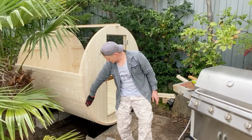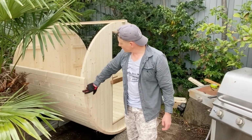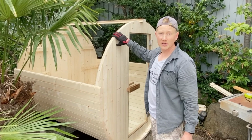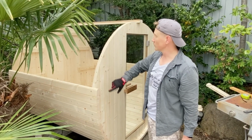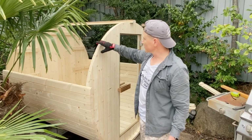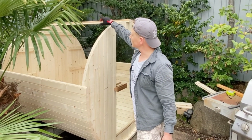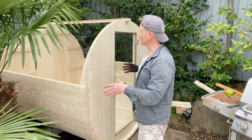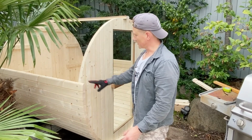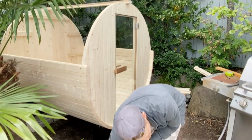Temporarily secured the side staves with screws. You can see they're not in all the way. From this point, we can just put the staves on, and they should be able to stay in position until we put the straps over. With this one, it could be a bit trickier because we also need to align the ceiling section, which has an opening for the flue to come through, with where the firewood heater position will be. So we'll have to work around a little bit, but at this stage we just start to put staves by themselves without screws, like so.